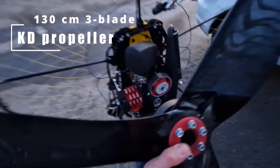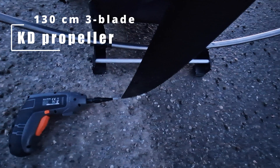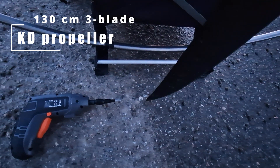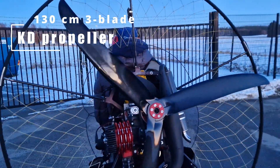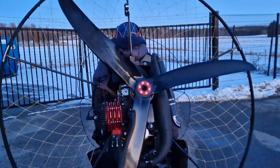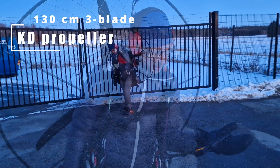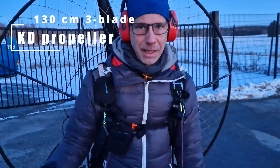I have to try the Ukrainian propeller. Let's see how the Ukrainian propeller tracks — one blade shows a little differently. It revved to about 7000 RPM this time. I notice the 3-blade revs less than the 2-blade. This one cools better than the Pesky at least.